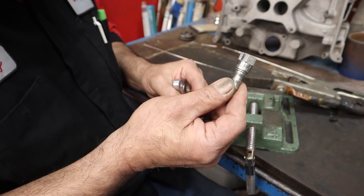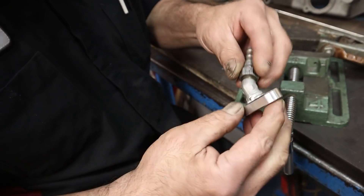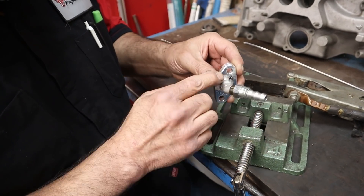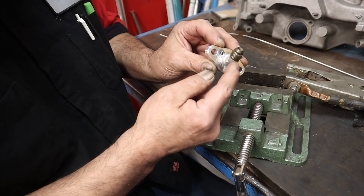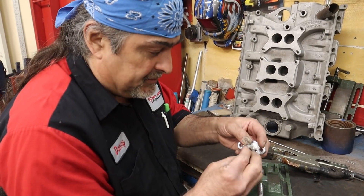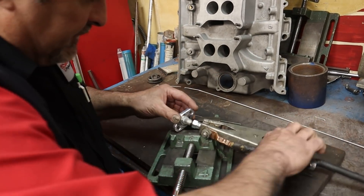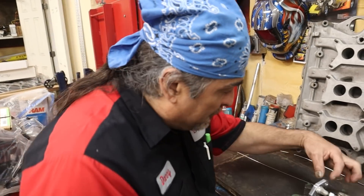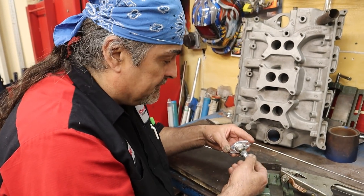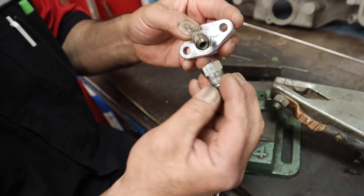The sacrificial fitting is back in action. We use this a lot. Tip of the day: protect your fittings. This is the one you use on the lathe for spinning stuff down. Now we're going to weld. A lot of times when you're welding, the arc's going to fly off and catch that high spot. I know it's pretty far off, but we don't want to take any chances — it'll arc across, especially if you don't have a good ground. It's much easier to do this, and not only that, check this out — now I have a place where I can even connect it here. Instead of trying to grab it here, it's going to find the path of least resistance. And so it'll arc across, which is protecting it. Tip of the day: cover up your stuff.